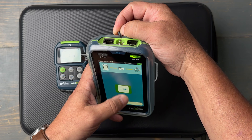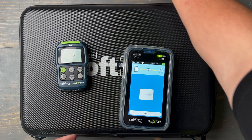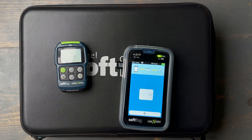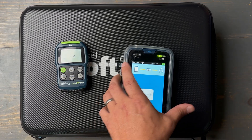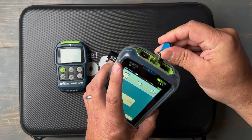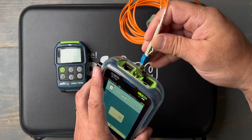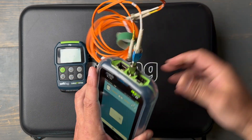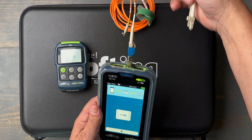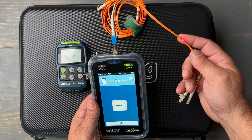So you've got a built-in red laser for troubleshooting fiber. Let's do that real quick — let's grab a fiber to test. I'm going to plug in an adapter here and take a peek at that fiber. The red laser should go through this and tell us where the open is, and sure enough we've got a broken fiber optic link here — you can see the light actually bleeding out of the jacket.